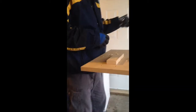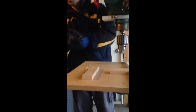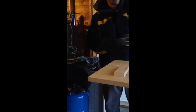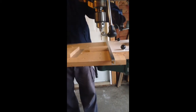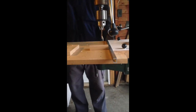One last thing I need to show you on this drill press is something quite simple but very useful when you've got a lot of work and a lot of shavings to deal with. Essentially it's just a magnetic dial indicator holder — I've taken a piece of heavy gauge wire and made it into a series of loops, and we can mount that right on our column. You can imagine a vacuum cleaner attachment going through here, and you can pretty much position this where you want to. Depending on how far up and down your table is, it's easy to adjust up and down, side to side, and get your vacuum cleaner attachment exactly where you need it for all those really dusty, messy jobs.